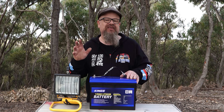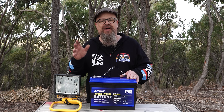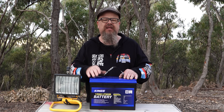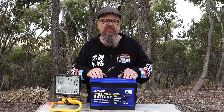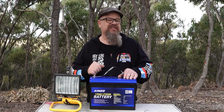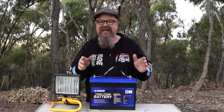The keen-eyed amongst you will have noticed I ran that test three times — not only for accuracy, but for my own peace of mind. Because the first one, I thought, oh no, I've obviously buggered something up. It couldn't be nearly 14% over its rated capacity of 120 amp hours — nearly 137 amp hours. By the second one with almost identical results, I thought, well, maybe it is. And by the third one, I was confident. At 5 amps of load, nearly 137 amp hours out of this puppy.